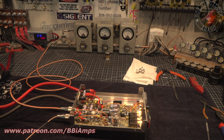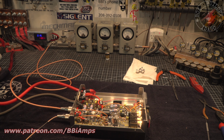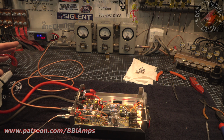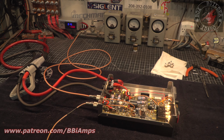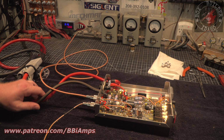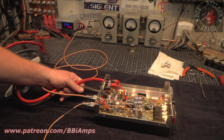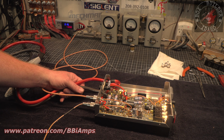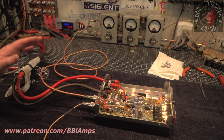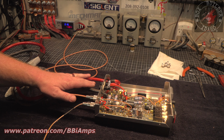See that 70-ish amps worth of consumption? That's why we go with a bigger Anderson clip like this. We don't go with a little tiny 50 amp one. It will cause problems if you do. It'll cause the amplifier to starve. Is it necessary to have this big a power wire going into this little 500? No, it's not. I do this to help people remember that just because it's coming out of the amp,